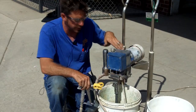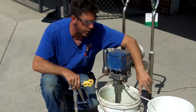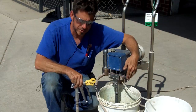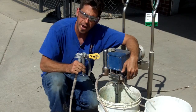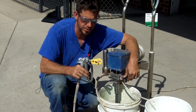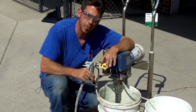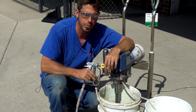It's going to circulate throughout the motor and drop that dirty water out this purge line here, which you can set into a waste bucket. When this is down, there's no pressure at all on your gun — no pressure at the hose — which is where we want to be for safety purposes just getting started. When you're cleaning or priming an airless it's best done with the tip out of the gun itself, so you're creating a straight stream and not adding a fan to that cleaning process.